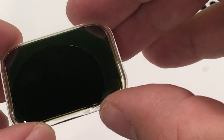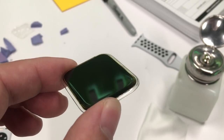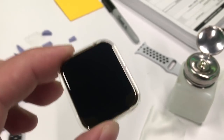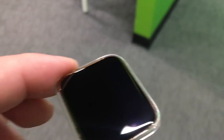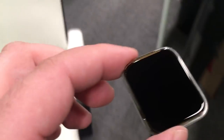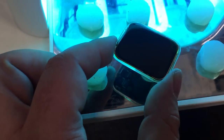As you can see it's spreading to the edges. Now that it's spread to the edges entirely, we'll center it — and once it's centered, we'll go ahead and place it under our UV light to cure on both sides. Luckily with a clear glass we don't even have to worry — it's going to cure wherever the LOCA is.